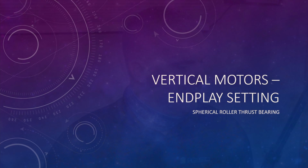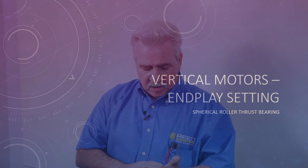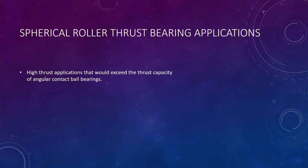So today, basically, what we're going to talk about is spherical roller bearings, doing the endplay adjustments. I'm also going to discuss some of the problems we're seeing with oil leaking on the same kind of motors. You can see on the screen that we're bringing up a spherical roller bearing application, and basically they're designed for extra high thrust capacity.